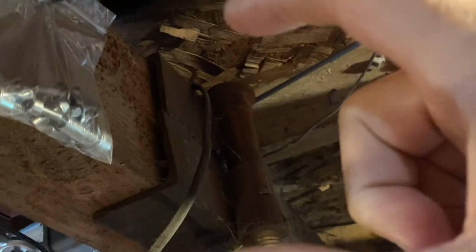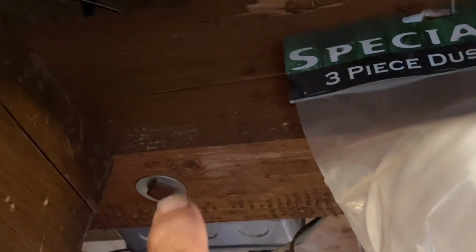Have a look up here, see now. This wooden beam, before we replaced it with the steel beam, was giving way, it was cracking. So in between times, I made my own brackets, got some scrap, picked it up, and made myself some brackets to hold the damn thing together, because there's a huge split that runs through here. Bolting it was okay, but I wasn't keen on putting another bolt through it, because I thought it was taking material from it and disturbing it. So I thought, I'll tell you what, I'll clamp it. So I made some clamps.